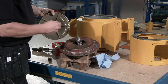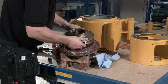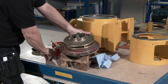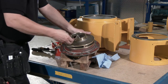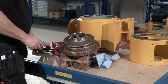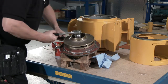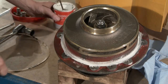Lubricate the impeller or shaft end and lead the impeller towards the shoulder of the shaft. Take care that the ring at the end of the shaft seal spring locates in the recess of the impeller. Secure the impeller with washers and nut. Lubricate the surface of the shaft seal cover and place the gasket.